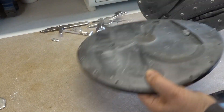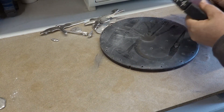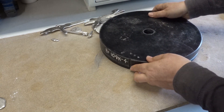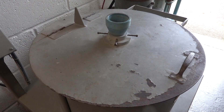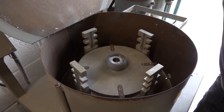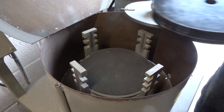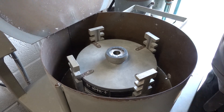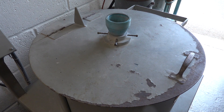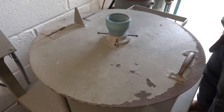The registration marks cut into the edge of the mold make alignment and assembly a simple process. The assembled mold now goes into the casting machine. The upper plate locks into place and an air ram pushes the base and the mold up to the preset pressure. Once the lid is closed the machine automatically starts spinning.